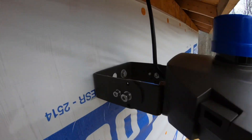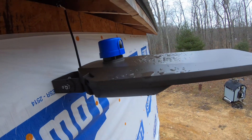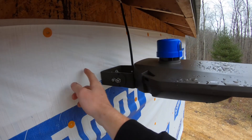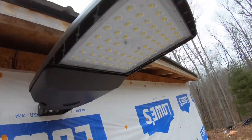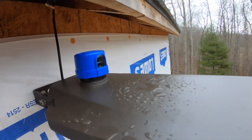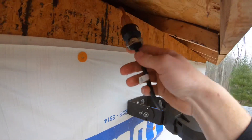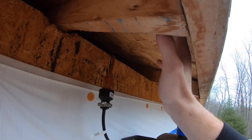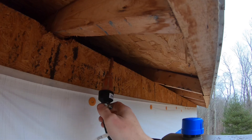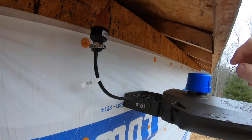In the daylight you can see how we have this mounted — basically just two lag bolts. I definitely wouldn't mount that to just OSB because that's quite a bit of weight hanging out here. We put a 2x10 in so it's got plenty of meat to grab onto. Here's a good look at the light's photo cell up here. Temporarily we hooked this up to an extension cord, and when we close in these eaves next week I'll put a receptacle up here, plug it right in, and if there's ever an issue just unplug it and put a new light up — super simple.